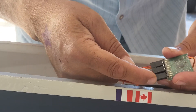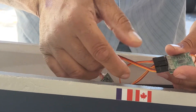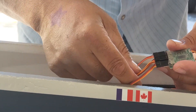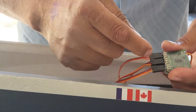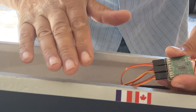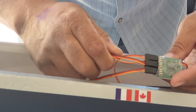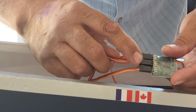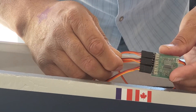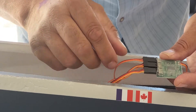This is the sequencer — the retract controller comes into it right here, that's this slot. The second one right here has two cables going into it. In the middle are the doors that open the landing gear: the gear comes down and after the landing gear is down, the door closes. That's why there are two cables — these are the two servos in the middle for the landing gear doors on the mains.